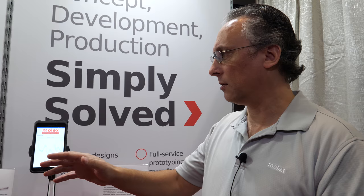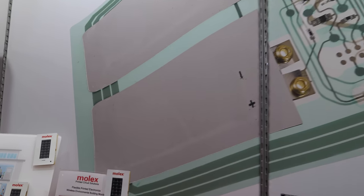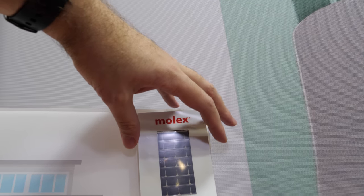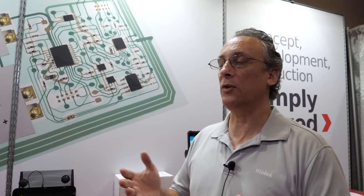Is there potential for something that transmits farther than NFC — even cellular? Something like LoRa — how long does the battery last on a LoRa device? You need to constantly charge it with solar because you're transmitting more power over a farther distance. That's the trade-off with the batteries — if you want a very thin, small battery, you get a limited lifetime. But you can choose to ping every half hour and still use a thin system. With BLE this will transmit up to about 200 meters and last three to six months depending on data collection frequency.